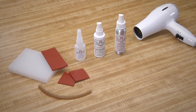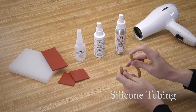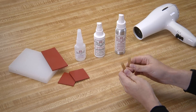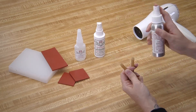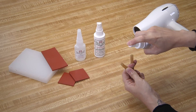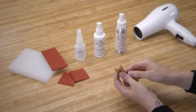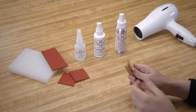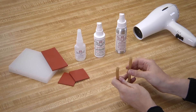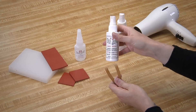We will start with the tubing. Before bonding, always make sure that the edges are clean. First, saturate both edges with the poly prep and let that dry. The poly prep dries the oils on the poly surface and etches that surface. Our poly prep is solvent-based, so it dries quickly. It is critical to then spray one end of the tubing with the activator accelerator.